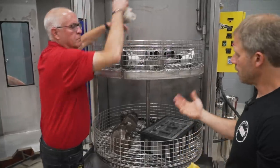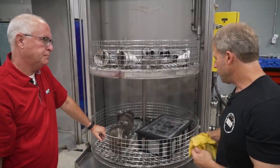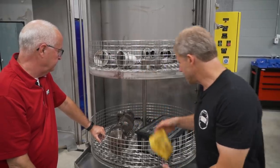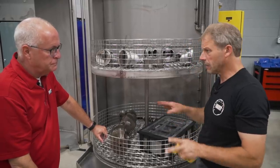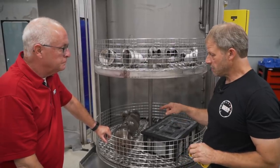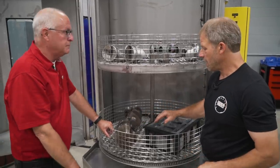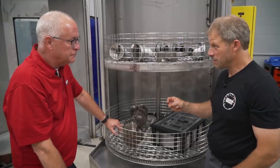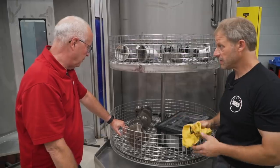Obviously, it's a water-based solution. It has a soap in it. So for instance, I have a cam or a crankshaft in here with journals. Let's say I was washing this for final assembly, so it's all polished, it's perfect, no flash rust on it at that point. Now, what I am seeing right now, with the exception of where the water is sitting in here, it looks like because of the heat involved, it's basically dried itself like that. It is. So I'm not getting the flash rust.